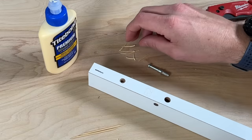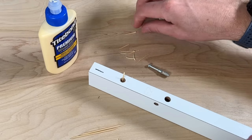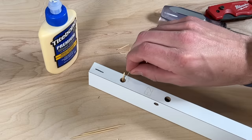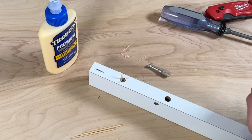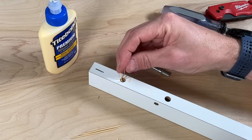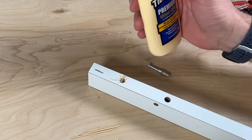It might not seem like much, but I don't need much. Put the slivers in, and if they have a tail that curls, curl it out away from the hole to allow the cam screw to actually seat. Line the perimeter of the hole with small slivers, then add a couple drops of standard wood glue inside that hole.